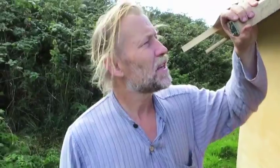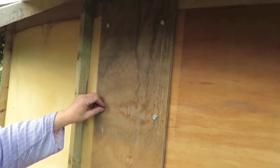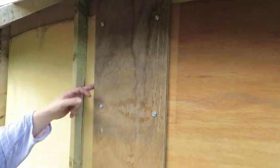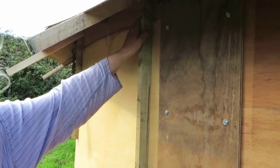On the outside, I'm showing you the roof timbers where they come out. The further out the roof comes, the less problem you've got with rain going under the edge of the plywood. You can see on the wall the joining plate — I've used an 8mm bolt on each side and the same 12mm ply to join it, and I've used this to anchor the roof tension onto the wall. The band forms round the outside producing a rigid structure, and when the roof is added it tries to push outward, so you need to attach your roof timbers to the side of the building so the middle cone can't drop. Apart from that, there's no serious engineering — only the cartwheel is engineered, but you don't need to go that exotic.